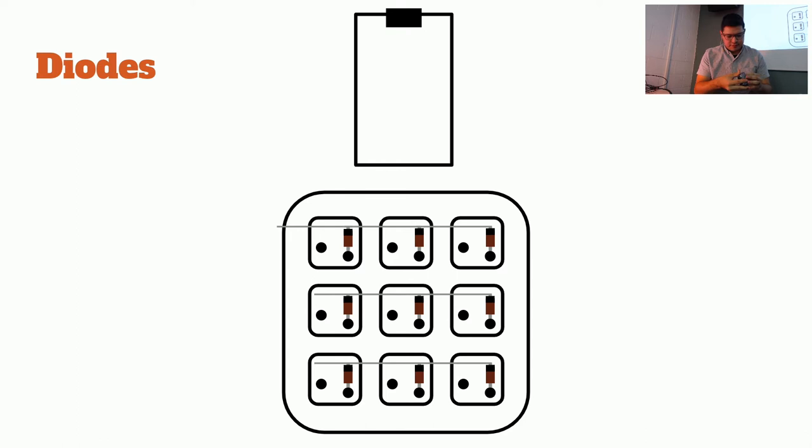See how there's two holes? You put wrapping wire on top and shove it down here. And that over what you're wrapping it around, and you go like that, and it winds the wire around it. And that's the old school way when they would do like prototypes, because soldering wasn't as widely available.